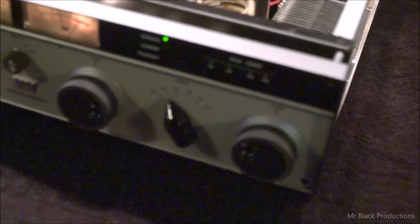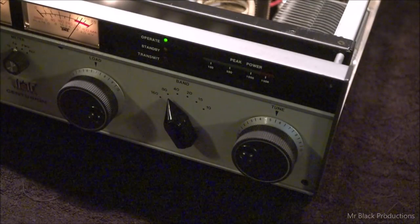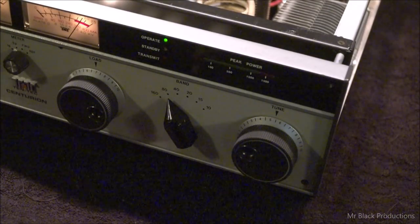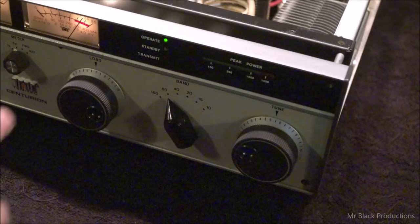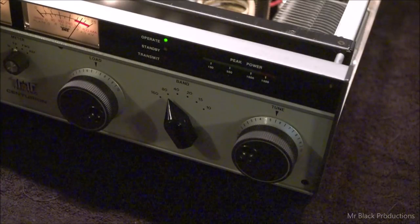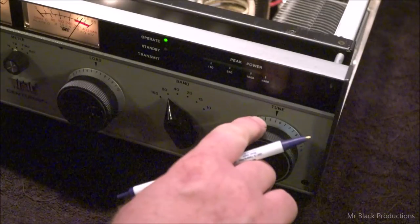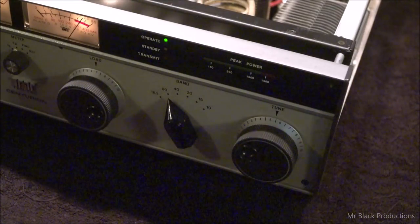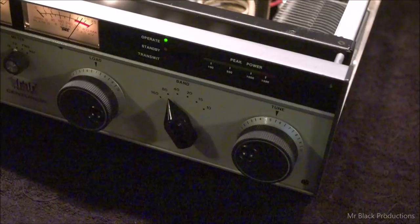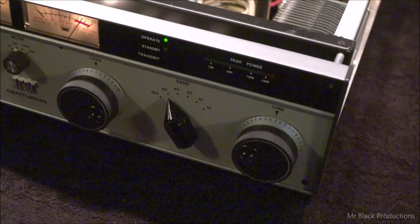And we'll back the camera out again. Let's see what we've got to write down this time around. So 80 meters in the middle of the band is roughly going to tune at about a 7.8 over here. And then over here, we're going to see about a 5.4. Okay, makes sense to me.